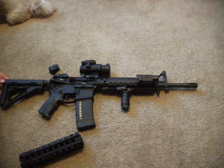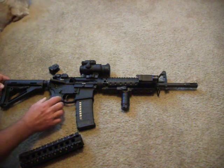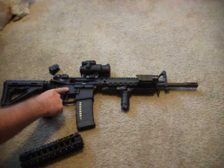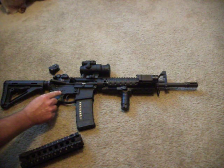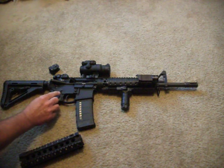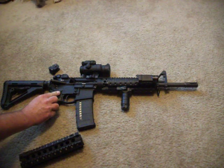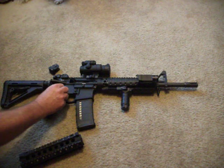It's your normal BCM 14.5 inch upper mid-length, built with a Rock River Arms stripped lower receiver with a Daniel Defense lower parts kit installed. The badass ambidextrous safety — this gave me fits when I first got it. It was mushy and wouldn't lock into place. I had to come up with a different number of spring and detent combinations to get it to lock, but it's good now.